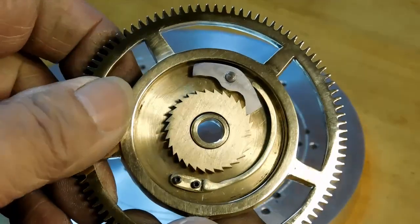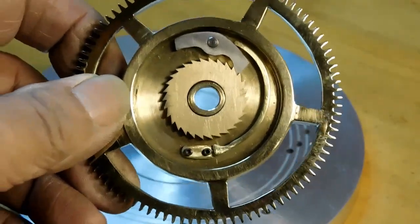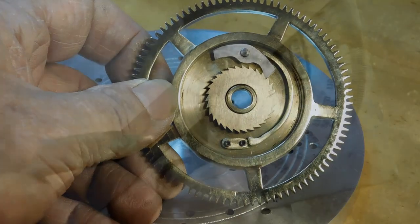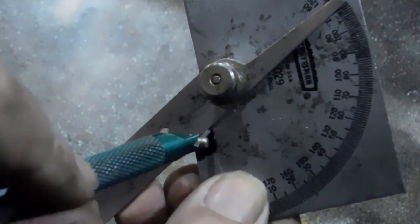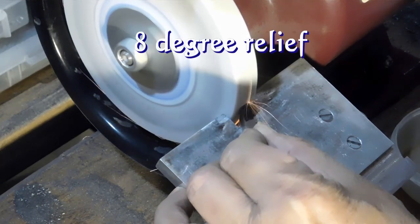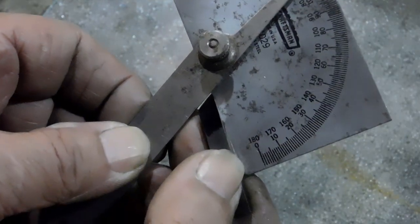This is the great wheel I just made. There's a ratchet, the click, and the click spring. In this video we'll start by making a 45-degree cutter to cut our ratchet wheel, put in a high-speed steel blank, cut with an 8-degree relief, and check our 45-degree angle.